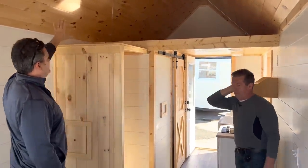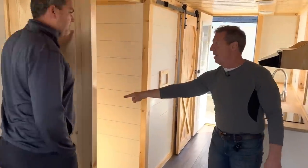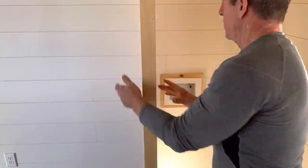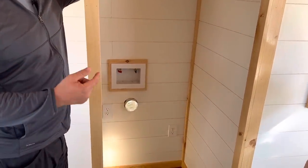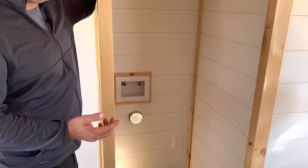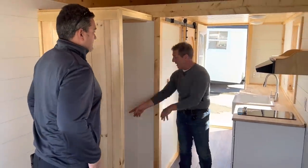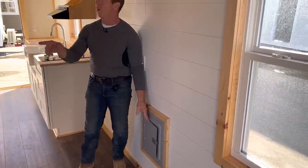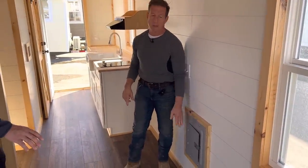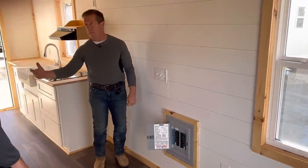You could take a plug from there, drill a hole, and mount a TV right here — there are two plugs in this room. The stackable washer/dryer units can be 110 or 220. We run a number-10 wire so if you have a 220 unit you'd upgrade to a 50-amp cord on your main supply. The wire is already run for either option. The house is wired for double-pole up to 240V, and the twist-lock plug outside is ready for it — you just swap the cord.